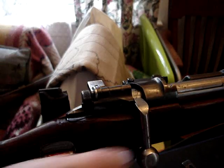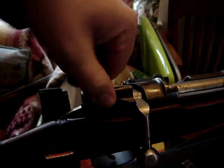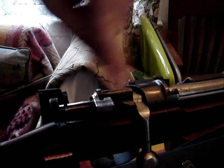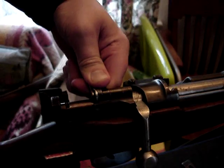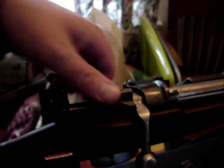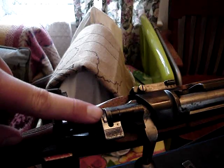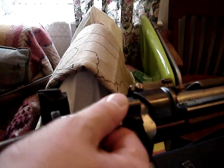This one is a 96, but it has the same kind of style of wing safety. You can see the wing safety is actually a different color on this one — this is off a Spanish 93. I don't know if it was messed with or the Spanish just didn't machine it very well. But it goes on, it's still quite positive, put it all the way over and it's not going to come off by mistake. But it doesn't make any clicking noise. Even if you do it quickly it will click, but if you just grab a hold of it and turn it off it's quite quiet. That's more or less because the areas between the cut-in sections are rounded, and the leading edge that first engages behind the cocking piece is well beveled.